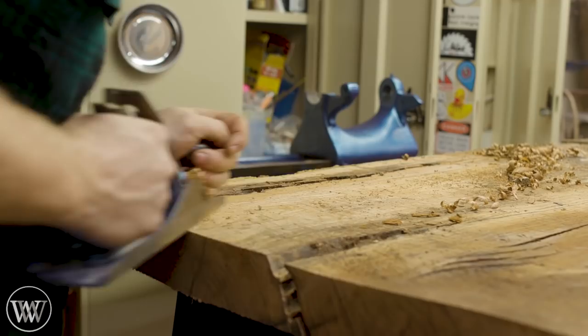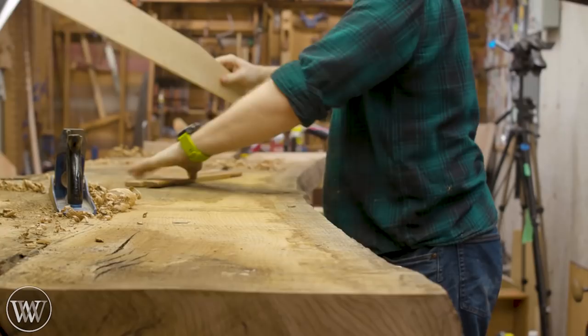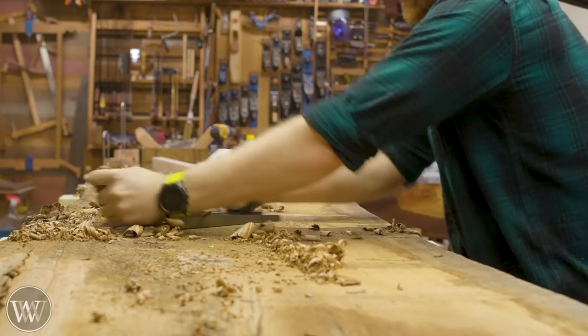Don't worry about things being too low. This piece was actually flexing and I cut it off later. I don't have footage of cutting these boards to width, but it's cutting so that's kind of boring. Bringing in a large straight edge will allow you to see any other high spots. There's a knot coming up in the middle that created a nasty high spot. The scrub plane takes it down rather quickly, and as you can see, that high spot just gets wider and wider until it's a large flat spot.